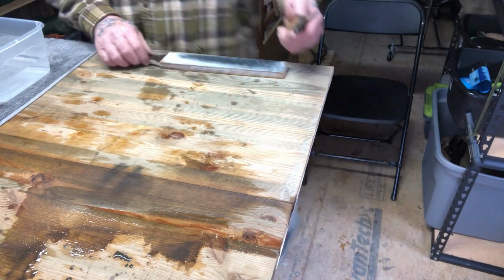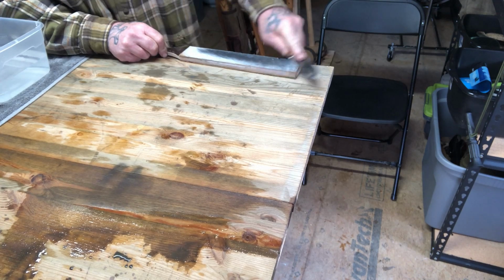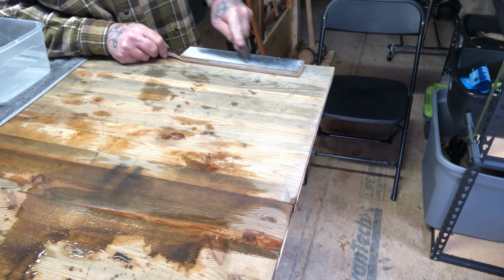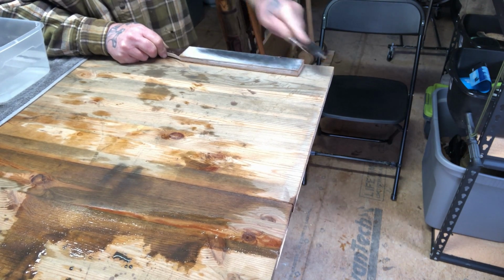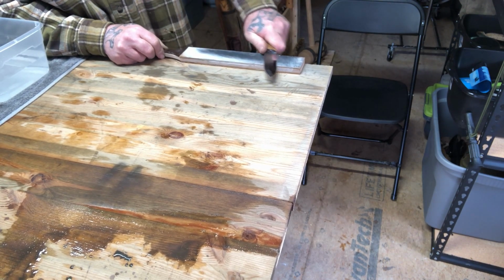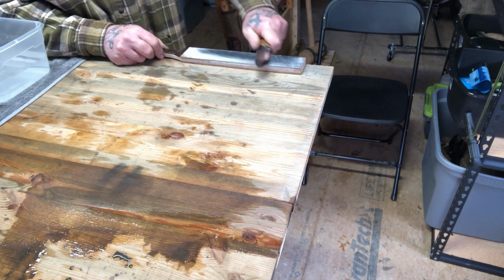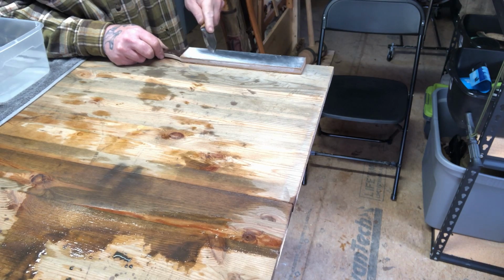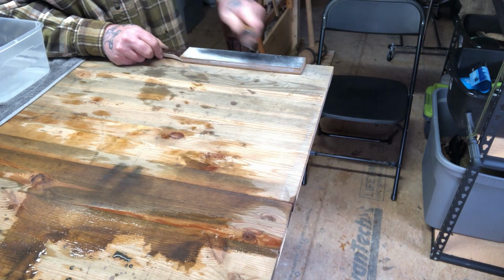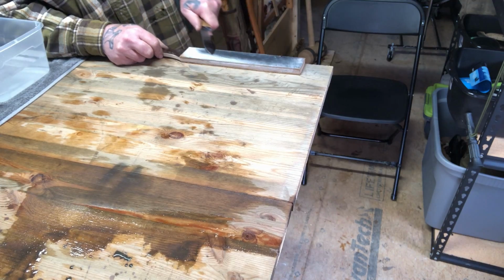And that tells you that that knife's been polished either on a high-speed buffer or it's been used on stones and a strop, and a lot of strokes on both. I'm probably already up to 100 on each side on the strop, and I haven't gone to the smooth side or the softer side yet. I'm still on the side with the buffing compound on it, but I'm getting ready to change over because I'm convinced I got that area I was worried about sharp. So again, there's no sense removing more material if I don't need to.